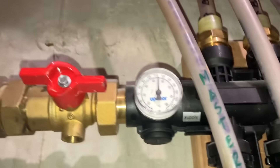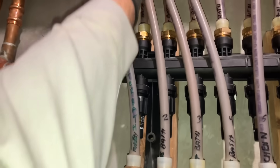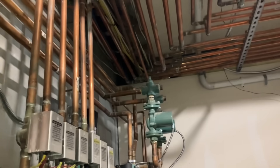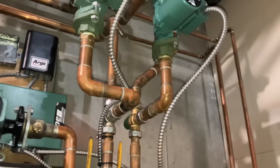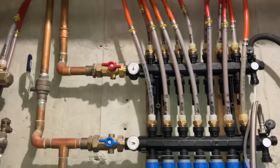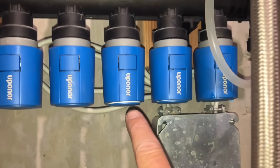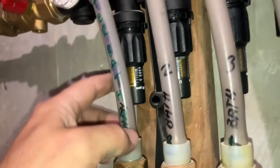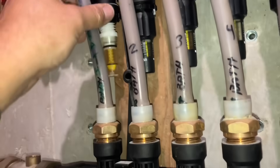I have a flow check — a pressure vacuum breaker — at the faucet, so I'm protected there. But if this were open and there was a pressure drop, I risk sucking boiler water into the domestic potable water, so I cannot stress that enough. We are climbing — looks like we're at 115 degrees. I have my mixing valve fully open so we have roughly 140 degrees of mixed water going to this radiant panel, hopefully getting up there in temperature. Loops five and six for the kitchen are slowly opening. And then — yeah — it looks like we dropped off on flow to the master.